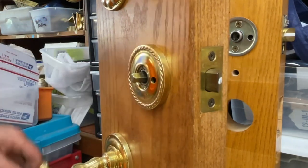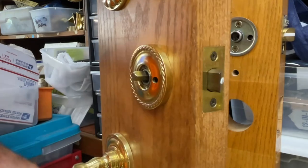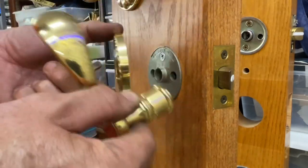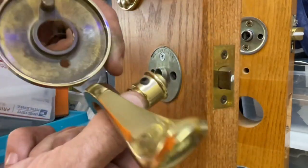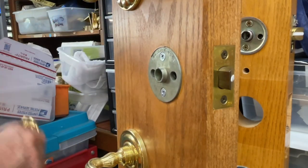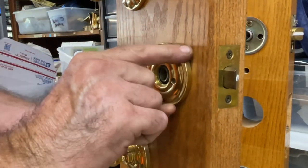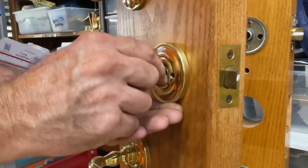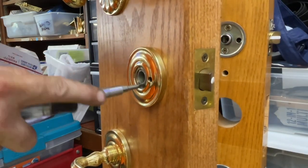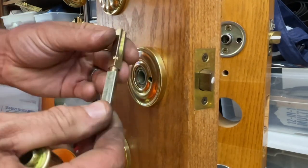If you have a box of old Baldwin hardware and they say 'put this on the door,' there might also be a white plastic guide washer in there — that is nothing but a guide washer to help you line up the hole during installation, kind of like we just did with the lever handle. It is not a functioning part of the lock. It is intended to be thrown out once you're done installing. So if you have a bunch of hardware inventory and you have those white plastic washers, they are not a necessary part of the lock's function — they are only for the installation.